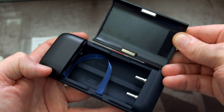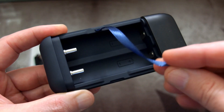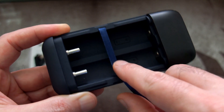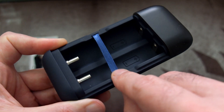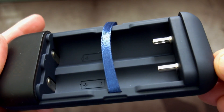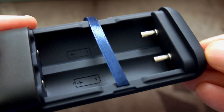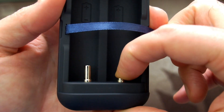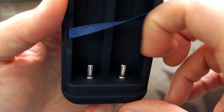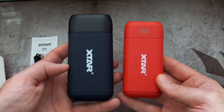Taking off the cover — which is magnetic just like the previous one — this time they've added a built-in ribbon so you can pull the cells out more easily, particularly the larger cells where there isn't much space. Inside the case you can see markings for positive and negative, and they've added raised contact points at the top. Instead of bare springs, they've used pins with springs inside, which appear to be chrome plated, and X-Star claims these provide better contact than normal connectors.